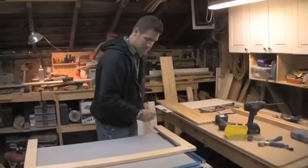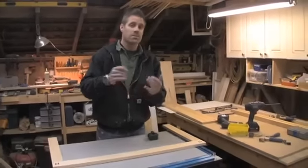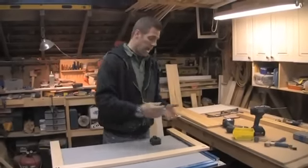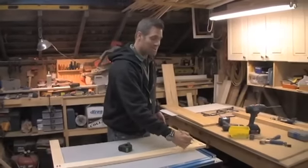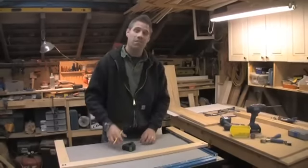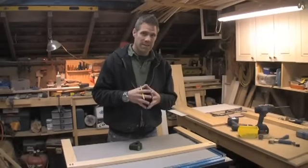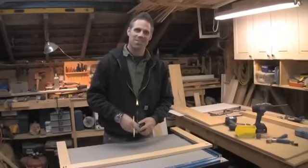The same thing applies if you're doing it this way as well. I've got an 18-inch style here. That 18 inches is 18 plus 3/4, your 3/8 on either side. Follow me here, you'll get it in a second. No, I lost myself because I was thinking. So it's 18 plus 3/8 and 3/8, 18 and 3/4. Then you want to take just a tick off. So basically 18 and 3/4, so it'd be 18 and 5/8. That way you have a little bit of wiggle room. You got it? No? Sort of? Okay. Well, you just email me if you have any questions.